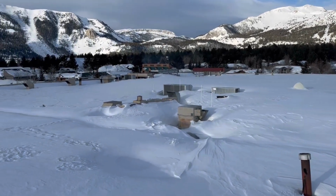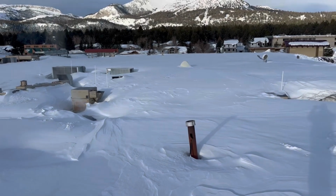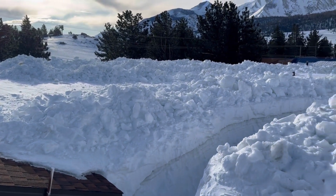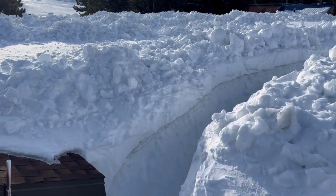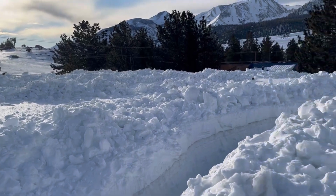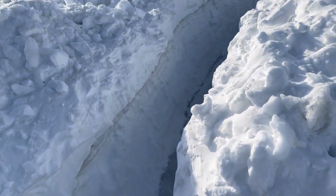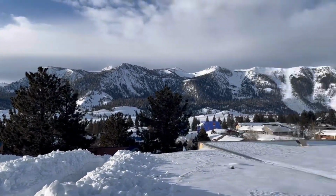This is the Vons roof. They want us to cut a curtain around the outside, but after coming over here and looking at their neighbors, these guys cut channels all down their roof for the rain coming, so it drains off the end. I think we're gonna cut channels too with the blower. There's one, two, three, like six. They cut channels all the way around their roof. Their roof looked like this a couple days ago. I like that. It's a good view today.